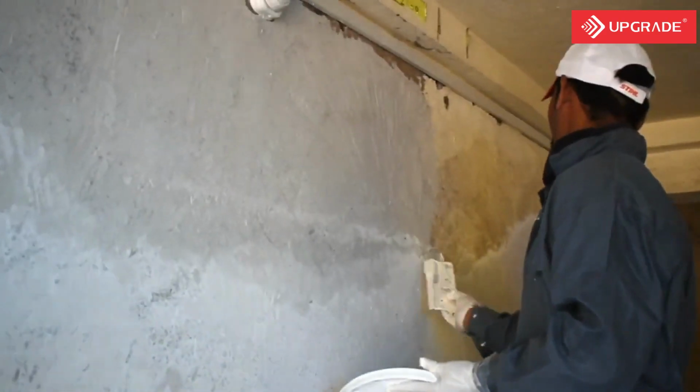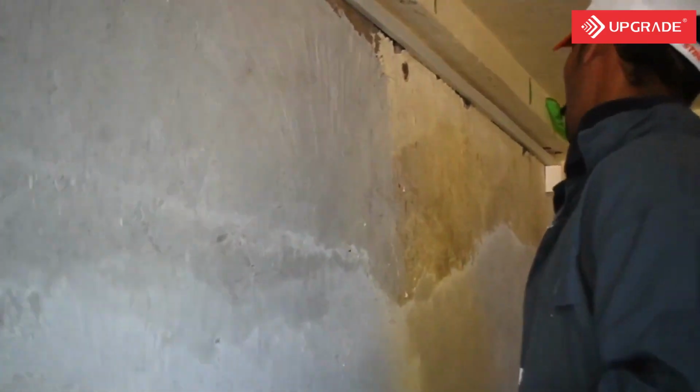Prepare the surface you wish to coat by cleaning it thoroughly, ensuring it is free from any dust, grease, or contaminants. Use white-based putty to fill the uneven surfaces before using a Duo coat on it.